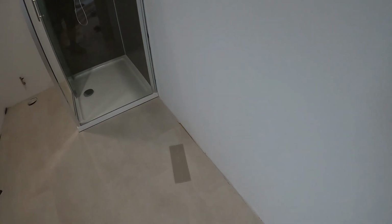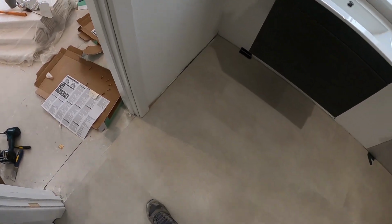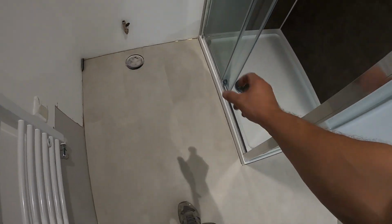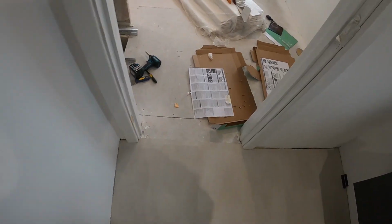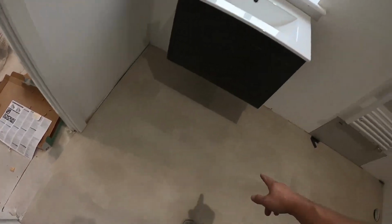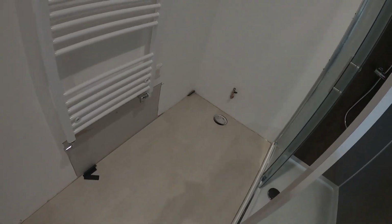We have finished, as you can see, we have fitted all the floors. This is for a bathroom. This is vinyl floor. It's fairly easy to cut, with either a saw or standing up with a knife when you've got smaller details like that. Smaller strips I cut with a jigsaw, and when I could go across, I did it with the knife this time, because it was quite easy. I must say, you've got to have a pack of blades, because it does get blunt fairly quickly. So this flooring job is done. We've done 4 bathrooms and have 1 more bathroom to do. Hope you enjoyed it and it helped someone, with little tips on how to do things easier.